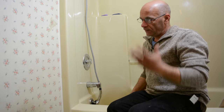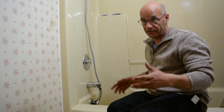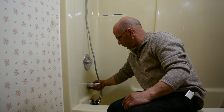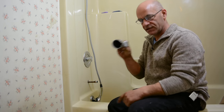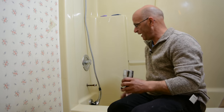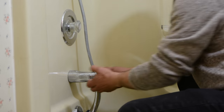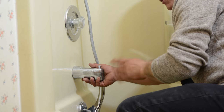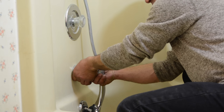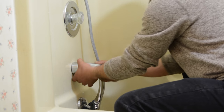If you're lucky, removing them could be easy — you take it out without breaking anything. I already loosened it up for the video to make sure it wasn't going to break. We're just going to unscrew it. You can see the threads in there, and there's some Teflon tape on it. You're really not going to use any tools — if you need a tool, chances are you're going to break that copper pipe going in there. Just grab it with two hands, turn it slowly, and unscrew it.